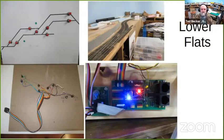Here's a simple, basic installation. You see in the photo of the track up here, this white styrofoam block is the north end of about an 11-foot long passing siding. About 3 feet down is this industrial spur, and I put in a crossover to aid in switching this industrial spur. So on the left, we see a control panel for that. I'm an advocate of push button route control, rather than a toggle switch or two push buttons per turnout. My push buttons select a route.